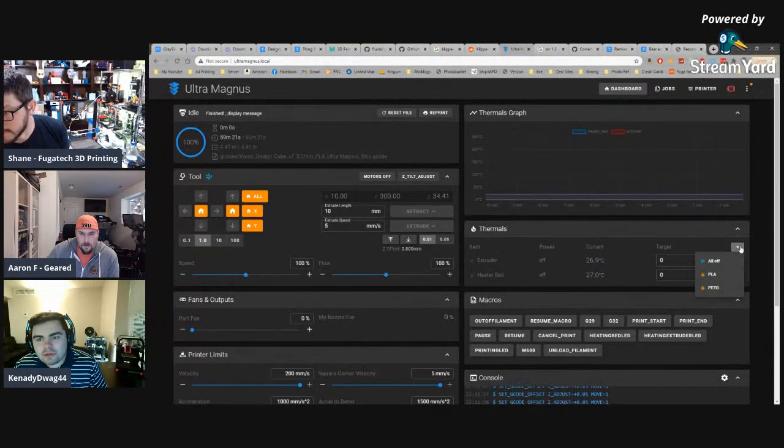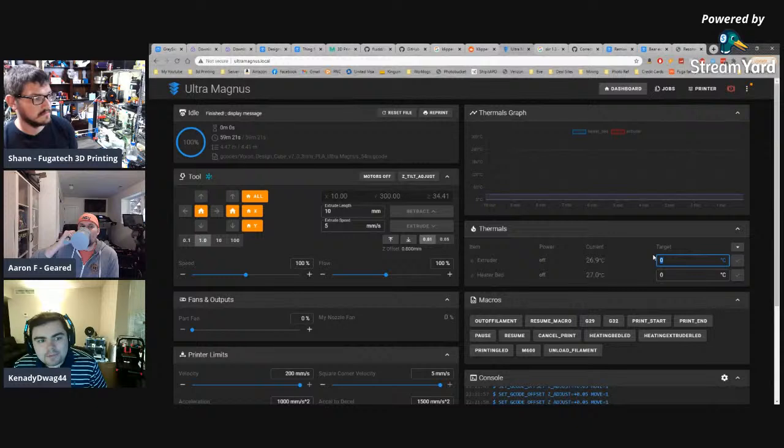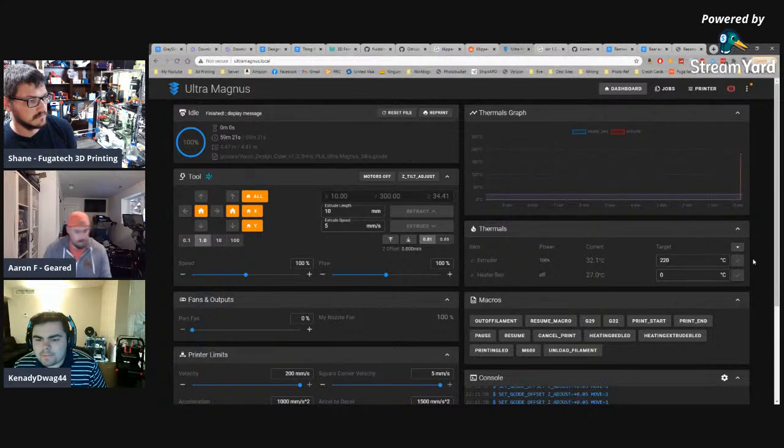So I don't know how it is on the SKR 1.3, but I know on the 1.4 you can actually power a Pi Zero from the 1.4 serial ports. It has enough power to do that. I mean, it'd be pretty easy to put a multimeter on it and check the amperage. Well, I guess not really, because that's only when it's pulling under load. I just don't know if the 1.3 has the juice to do it. Or not the juice, but the pins. I've never used the 1.3, so I'm not sure. Well, that definitely sounds like a research point for the near future. Yeah, let me see what I can come up with. We can just have Aaron be Mr. Google tonight.